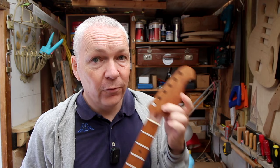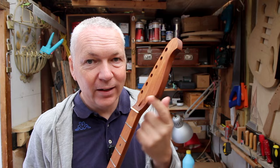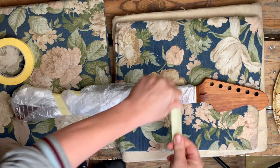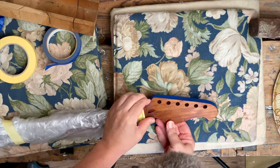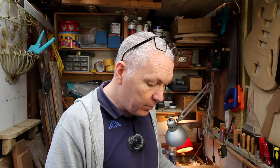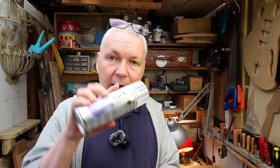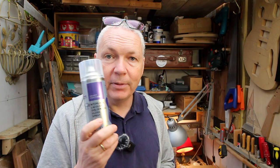The next step is painting the headstock. For that I have to tape it up — it's actually a little challenging to tape the curved part. It's not perfect at all, but I'm going to paint Olympic White. I got this from Nitrolag. A thin layer of white, and after that I'm going to give it this Golden Age Gloss Spray — a clear nitrocellulose that is supposed to crack very easily to look old. So I'm going with that.